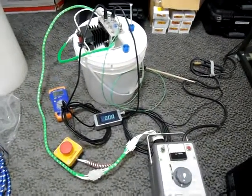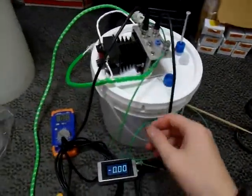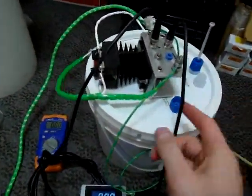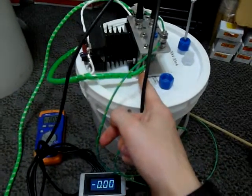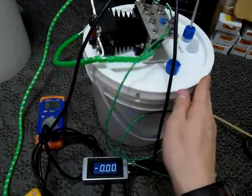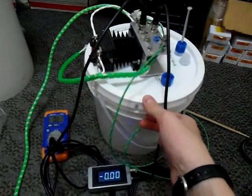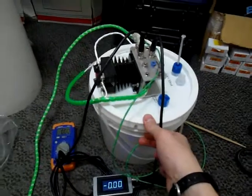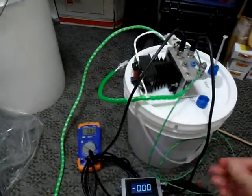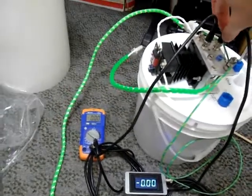Metering of voltage and current on the high voltage side of the transformer. The current is monitored with a 100 ohm resistor in series with the positive end of the bridge rectifier in the transformer bucket. This will provide one volt of output for every 10 milliamps of secondary current, so 30 milliamps would be 3 volts out of the center of the current BNC.